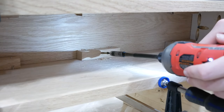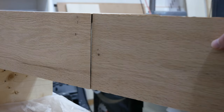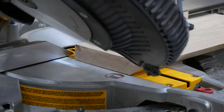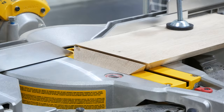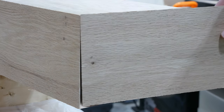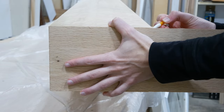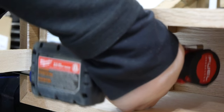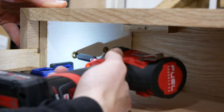I'm making the boards for the ends of the beam from those leftover pieces of the front board from earlier in the video, but currently the bevel is in the wrong direction, so I cut a bevel on the opposite 45. Using the leftover pieces from the front piece allows the grain pattern of the front to wrap around the sides of the beam. I marked along the back of the piece and cut it to length, then with glue on all the beveled edges, I clamped it and added a couple of 1 and a quarter inch washer head screws through the inside to secure the side piece.